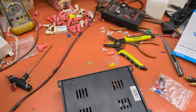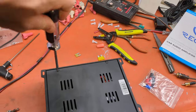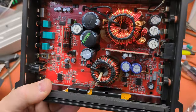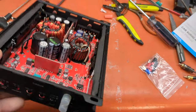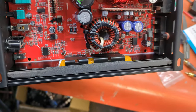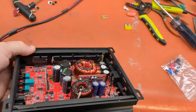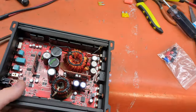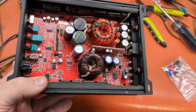Let me go ahead and get the bottom off. This one has switched to the new T15 hardware. Here are the guts — let's get a good picture of it. It looks like just two pair on the output section, and then this looks like the diode pack, and the power supply is quite large. That's two, four, six, eight — eight devices for the power supply side.